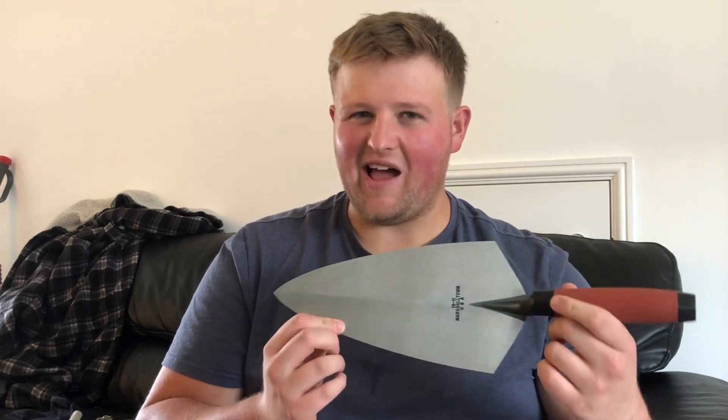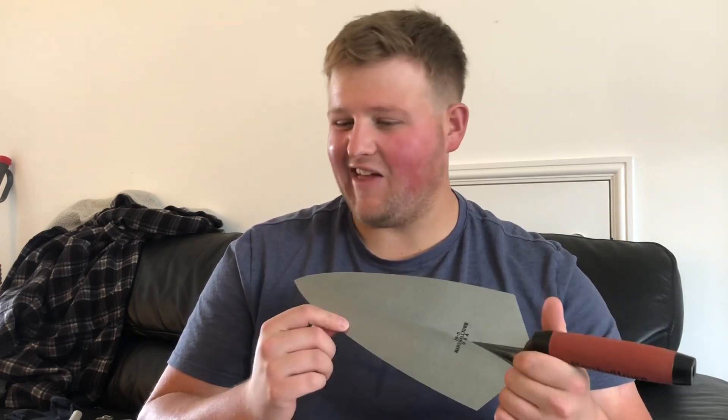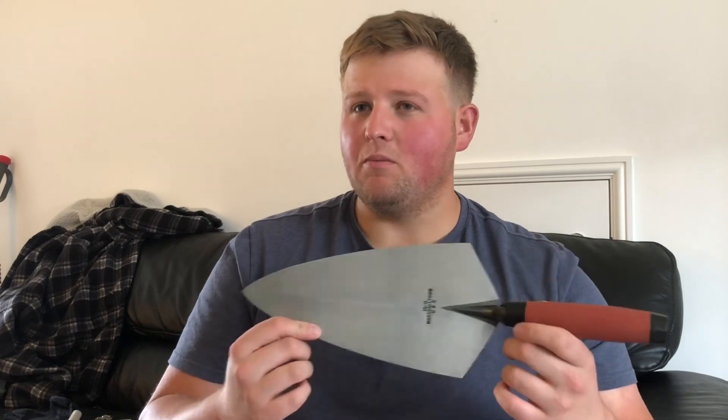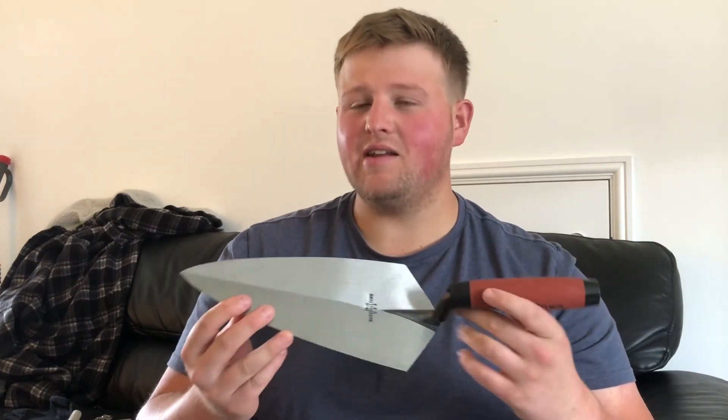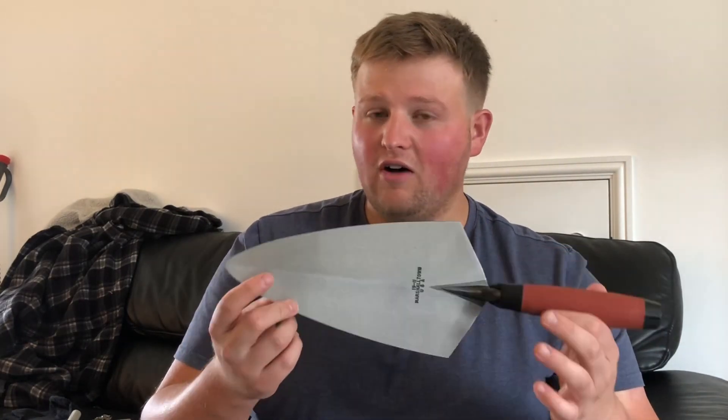The 11-inch trowel is sort of the most common trowel that everyone owns — it's a medium size. There are 13s and 12s out there, and pick-and-dip guys tend to use 9s and 10s. When it comes to general building, your ideal minimum size for footings or blockwork is around 11 inch. There are some common misconceptions about wrist strain with big trowels and how to mitigate those things with pick-and-dip style or traditional laying and corner building.